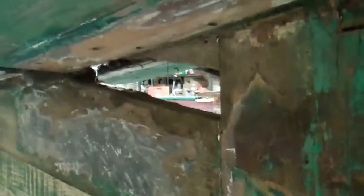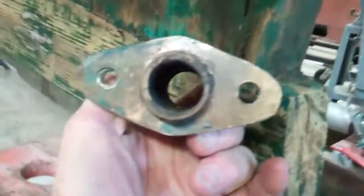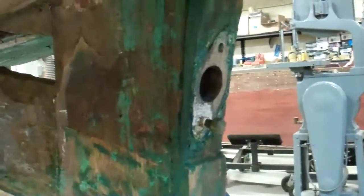At the very least, these people could have purchased some copper tubing that reached all the way to the back of the boat, but I guess they decided to use whatever they found. So what we're going to have to do is route out a dado around this on both sides, fill in with solid wood, and then re-bore the hole all the way through. This fitting is no longer round — you can see how it's all worn on one side — so we will have our machinist put a bushing in there and fix that. We're going to put the cutlass bearing at the upstream end of the prop shaft where it belongs, so that Karen and Dick can inspect it from time to time and make sure that it is slowly dripping water as it's supposed to.